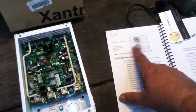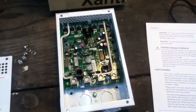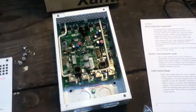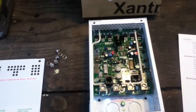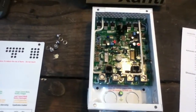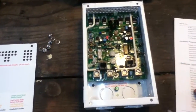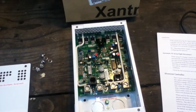This configuration depends on whether you're setting up a 12 or 24-volt system — we're doing a 24-volt system. So we have a high and low voltage cutout to check and configure. These settings can also change if you set the unit up as a diversion controller, meaning if there's surplus power being produced it will allow that power to feed through to another device, battery setup, or array. I'm not setting it up as a diversion controller at this time, although I probably will in the future.